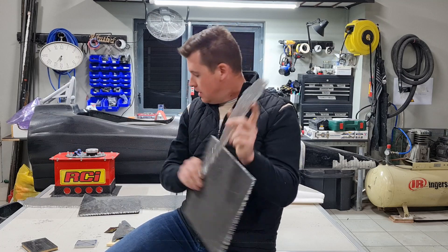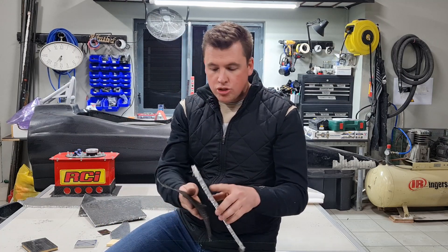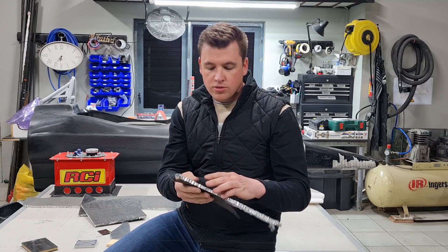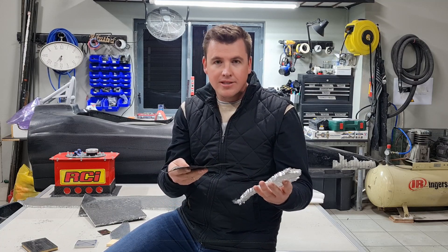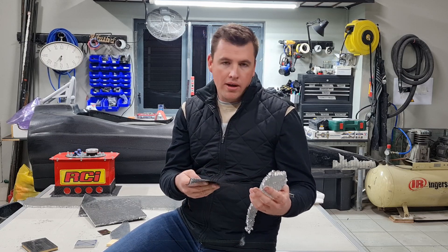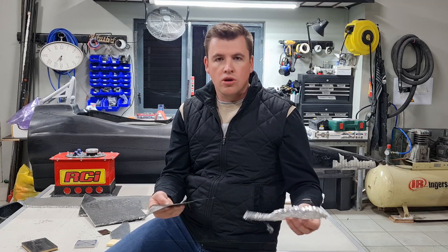The biggest potential issue was that there's supposed to be a laminate or layer that almost acts as an adhesive between the carbon fiber skin and the core. Where the carbon and the core meet, in between there is supposed to be an adhesive layer. The problem for us was finding a room curable, out-of-autoclave product to do that — we couldn't find anything, and the solutions we did find were just not cost effective.